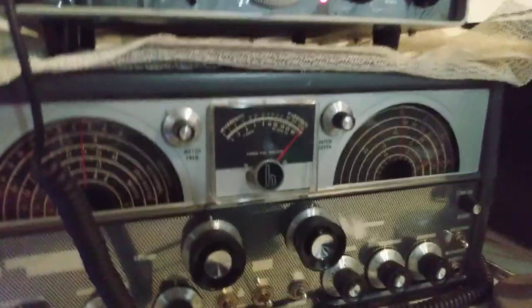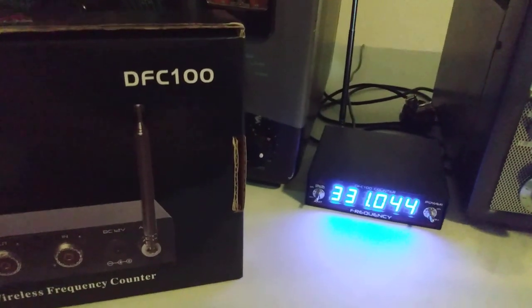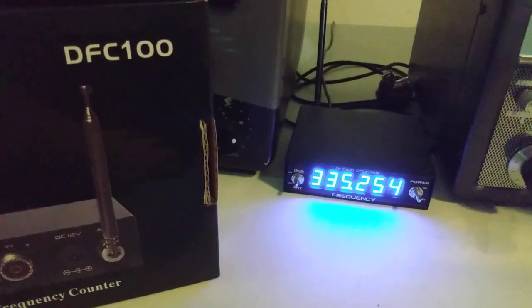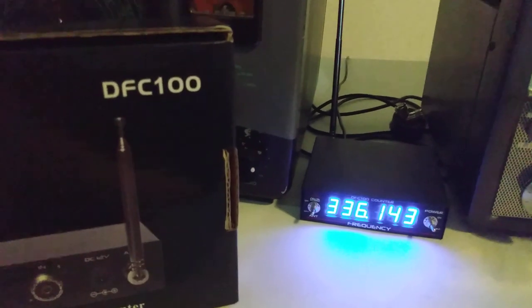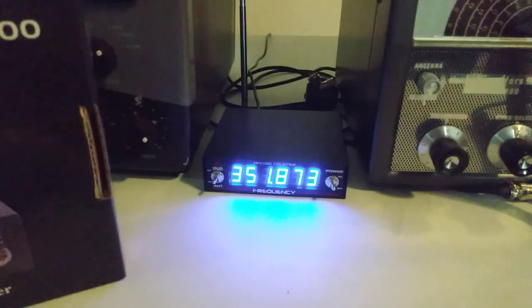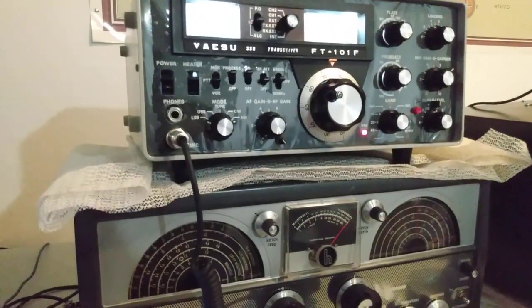If they're miscalibrated or anything like that, it's not gonna be accurate. Anyway, there's my good old SX 100, there's the Yaesu. I wanted to do this on the test bench but on a dummy load the antenna on this thing doesn't pick up enough because a dummy load doesn't put off enough field strength to make the frequency counter react. It's basically a sniffer — the antenna takes a sample of the RF, sniffs the RF, whatever you want to call it. Anyway, hope you guys enjoy — DFC 100 frequency counter. I've got a stack of them if somebody wants one. Questions, comments, complaints — shoot me a text at 423-299-3535, Rooster in Tennessee. See you, bye.